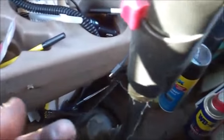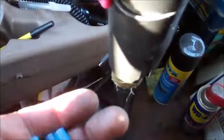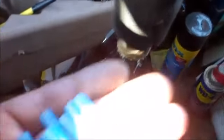See, I bought these ones, but they're too small and they're regular ones. They don't shrink. And thanks to one guy from Washington who told me about these ones, I just went inside the TA shop and they told me how they work. He told me that you cannot leave too much wire. Basically, you have to leave like 10 millimeters, and then you heat them with the lighter or match or whatever, and they just shrink. Beautiful.